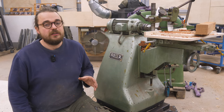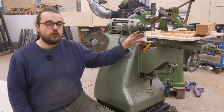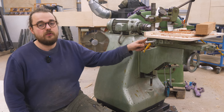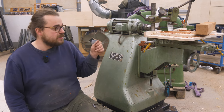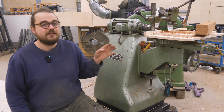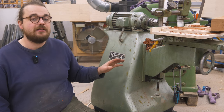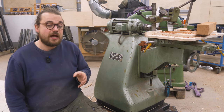I'm sure I haven't addressed every point. A viewer wrote about expensive replacement parts — that's not the case. I've shown you when a weld seam breaks: I welded it with a 200 euro welding machine and a grinder, used a TIG welding machine with normal steel additive, heated it up a bit, and ground it free with a thrust disc for 5 euros — then the whole thing works. It's not that bad if you spend a little time on it. There are people who find these old machines really interesting and want to keep them in their basement.